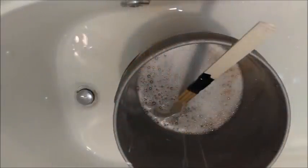We're going to get to the last portion of the inside application, and that's where I'm going to mix up a couple more packets of Boss. So what I'll do is I'll get 2 more packets of Boss, and this will be the last application inside to the toilets. And I'll mix them up with a couple of gallons of warm water, about 80 or 90 degrees. Doesn't need to be scalding, but it does need to be warm enough to activate the enzymes in the bacteria. And you'll put that down the toilets, and if it flushes, that's okay, because you're going to flush the toilet once more to get 2 flushes on the toilet. You let that sit for about a half an hour if you can, and then we will move on to the outside phase.